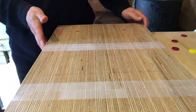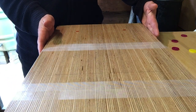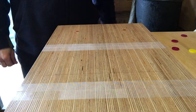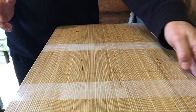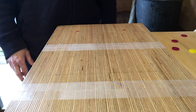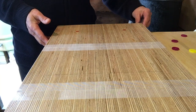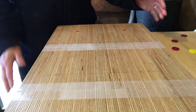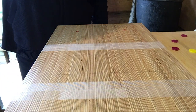Okay, let's get you over to the bench and I'll show you my plan. During the construction of the bench, these laminated pieces are screwed together using 30mm screws. Although I probably could have just glued them and clamped them, I didn't want to go off piste too much and do it differently to how I was supposed to do it. So I used the screws, even though I knew that there would be a problem when it came to drilling holes for bench dogs.